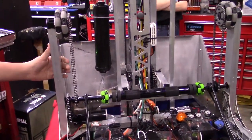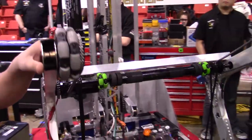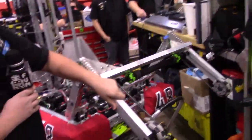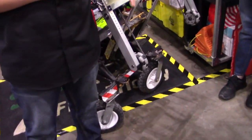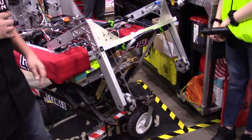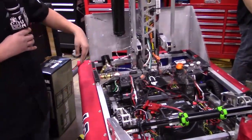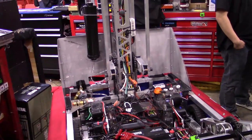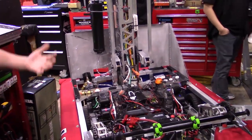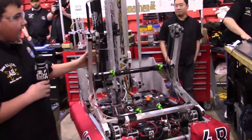We have what we call a monkey bar arm — this is what climbs our robot up to HAB 3 and HAB 2. It will stick out to 90 degrees and we can push it down to climb. We power Omni wheels at the bottom to move ourselves forward onto HAB 3, and we have a stinger in the back. It's a rack and pinion gear set that pushes straight down in the back with a wheel on the bottom and a ratchet so we can only move forward towards the HAB. Then we can tuck everything back into the frame and get ourselves a climb.